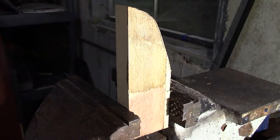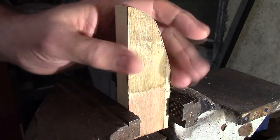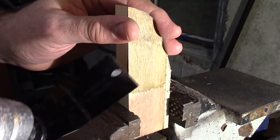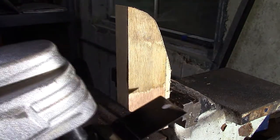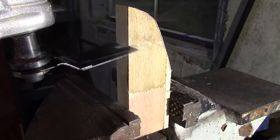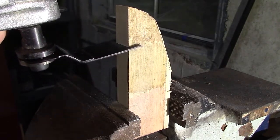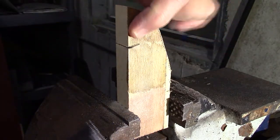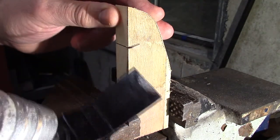Here I have a piece of hardwood — not pine, it's a hardwood I was staining and testing. Here's the dull blade marked with whiteout. Let's see how it performs. You can see it's hunting a little bit, not cutting a straight line, and if I kept going this would just get hotter and hotter and start to smoke.